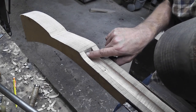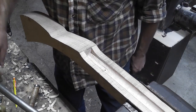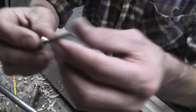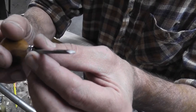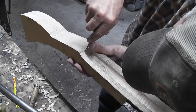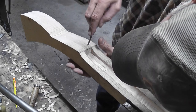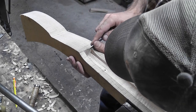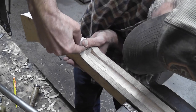We're just touching on the top there and a little tiny spot over here. I'm going to take my little mortising chisel — this thing is like a diagonal razor, and that's what you want. Start cutting these high spots — the black spots — off. Very, very little amount of wood, not much at all. Then put the barrel back in and do it again.